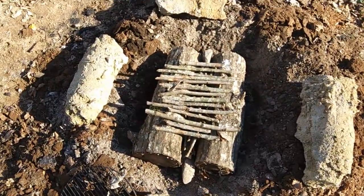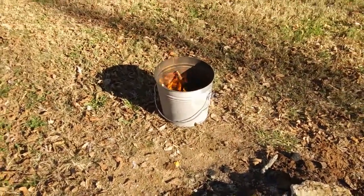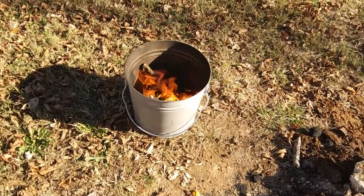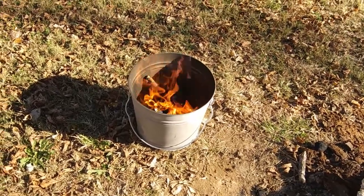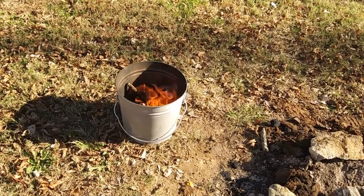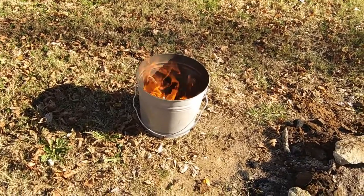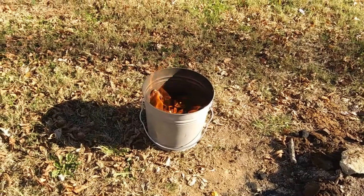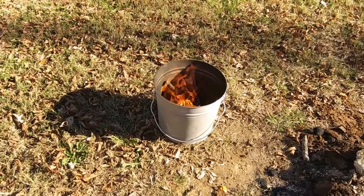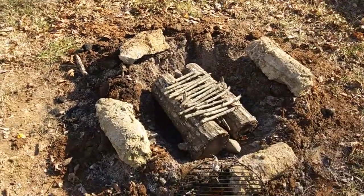I'm going to throw some lighter fluid in there and we'll have some fire going. Of course, that bucket is still burning on the inside — I want it to burn real good. It's pretty much got that burned off inside there. When you first start it in your bucket, or even first put your bucket on your main fire, when that zinc burns off, it's going to be black smoke — black toxic smoke. Now the smoke is normal color, white or gray, and that's when you know you're getting there as far as that oxide coating being burnt off. Also — once I've squirted all my charcoal lighter fluid in there and all around it, it's a good idea to let it soak into the sticks for a minute. That way it doesn't just burn right off. Another little tip there.